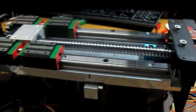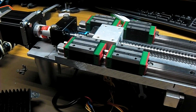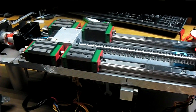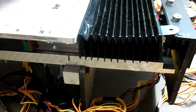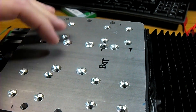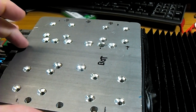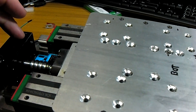So that's the bulk of it. There are a number of little things that come out to bite you as you're trying to put it together. This part is not actually attached - this is just to allow it to sit flat on the table. Bringing it together, it's closer to how it'll look. The spindle itself sits in an aluminium mount here that attaches to these outer three holes on each side. These holes are for the bearing blocks, these are for the nut to move it up and forward, these two on each side are for aluminium brackets for the end stops, and this one's in use - the other one uses the actual metal attached to this nut for detection with this little blue sensor.